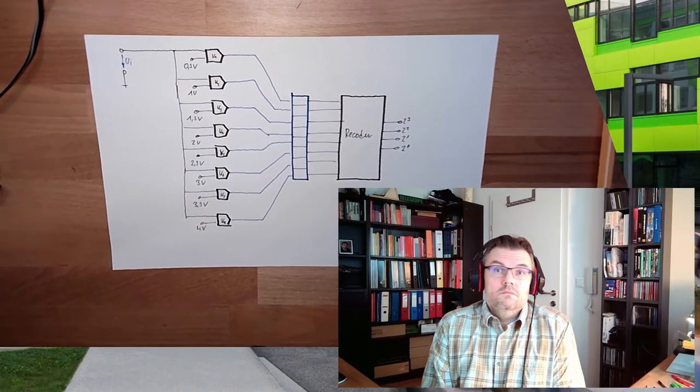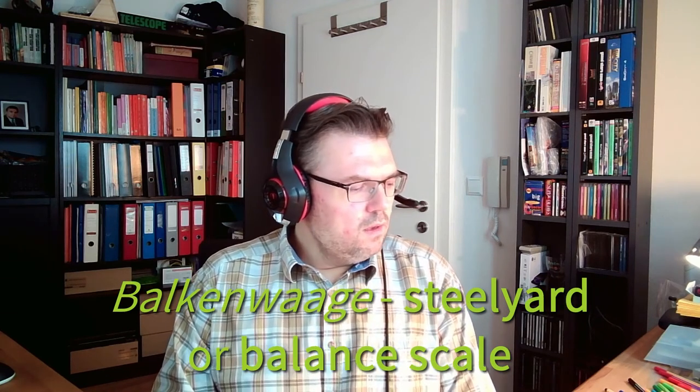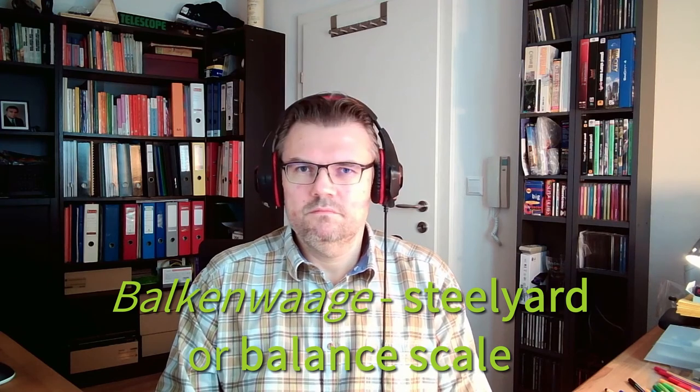So, well, that's it. That's what I wanted to tell you about analog digital converters. There are more converters out there. There are more methods, not like sand on the beach, but pretty many. There's, for instance, the weight method, where we use the bits not in order, but in order of significance. We add a high significant bit, and if it's too high, we get rid of it and use the next one, and so on, like we're using a scale. It's called scale. Look it up: Waage, Balkenwaage.